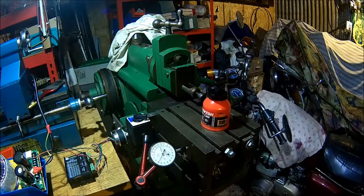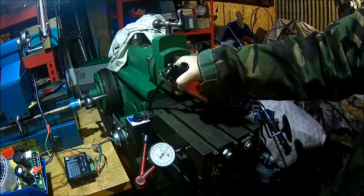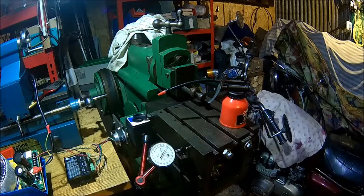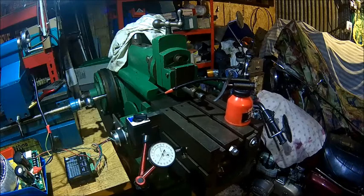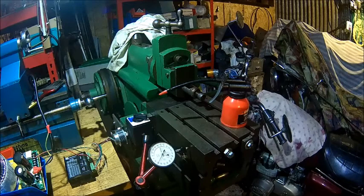As you can hear, we're losing steps here, which is bad. The machine is well-oiled, it works. The problem with this motor is it's a three-wire motor, so you can't really switch it to low voltage. I'm running about 60 to 65 volts at the moment — that's the maximum the driver can do. But I'm generally happy it works so far. I think if you cycle a few times it'll get better.